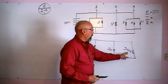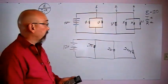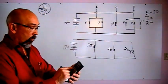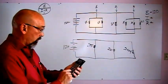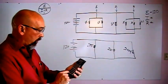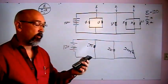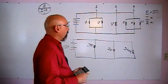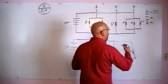We're going to take these 3 and do them exactly like we did those 3 to come up with the total resistance of our circuit. So our first branch, 0.75, 1 over X, plus 2, 1 over X, plus 0.2404, 1 over X, equals 1 over X, and the total resistance for this circuit is 0.1668, or you could round that up to 0.1669 if you'd like.